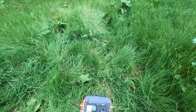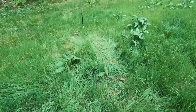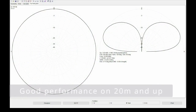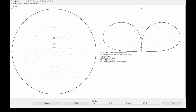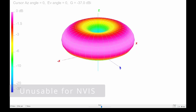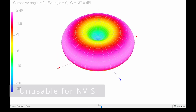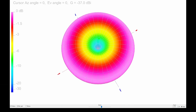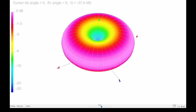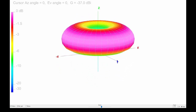The antenna shows good performance on the higher bands, especially for DX, because of its low radiation angle — by higher bands I mean the 20 meter band and up. It's a compromise antenna on the 40 meter band due to its low efficiency there. It's not usable for NVIS (near vertical incident sky wave), which is no surprise since the radiation pattern of a vertical antenna has primary gain towards the horizon and a null in the vertical direction.